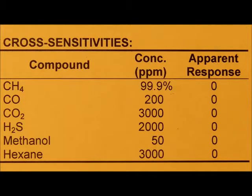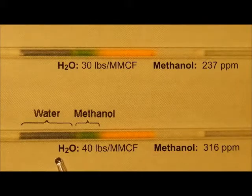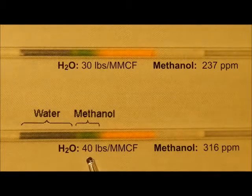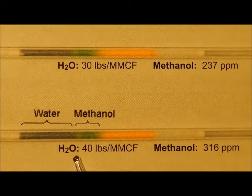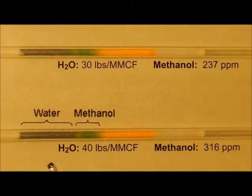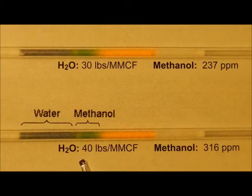Finally, it's always a good idea to check for possible cross sensitivities on the tube sheet. Although it is known that methanol can respond on the water vapor tube, less than 50 ppm of methanol shows no effect. A typical response when water and methanol are present together is to form a two-tone color, with the water forming the darker color and the methanol forming the lighter green color. In this case, one would read only the dark stain as the water concentration. However, when the concentrations are lower, it is often difficult to distinguish these two, and therefore one must take the total reading as the water concentration.